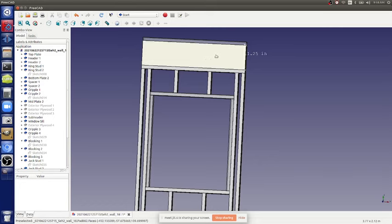If you wanted to avoid the header, possibly. But then what you end up with is a hole in your second floor. So then you have to address, if I need 12 or 24 inch spacing for the joists, how are you going to span that? You'll probably have to double up the joists around and put other members in between. So yes, you can do that. But it'll be lower cost to do this because you're simplifying and actually probably using less materials. And this does carry the same weight.